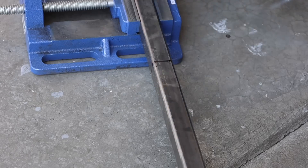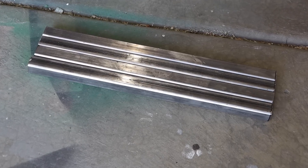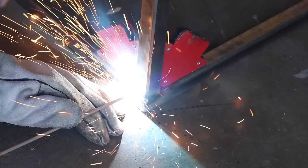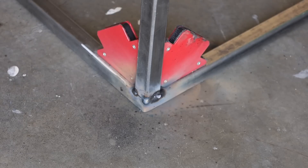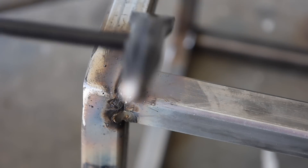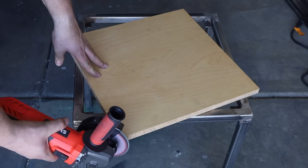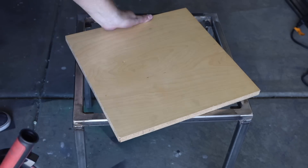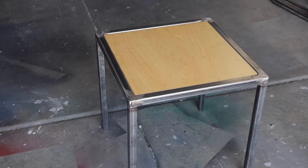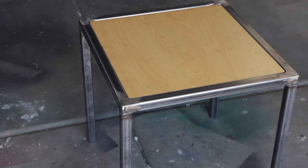Now I'm turning my attention to the legs. I've cut four pieces 17 inches long, which will give the right table height. After cutting each piece, I use my magnetic fixture blocks to hold them in place and put three tacks on with 6011. Once I have three good tacks, I prop the table on its side to run the outside welds in the flat position — much better than being right on the ground. The table frame is pretty much done; now I grind those inside fillet welds so the board can drop into place.